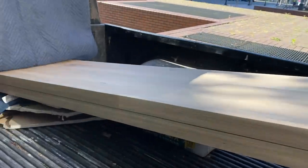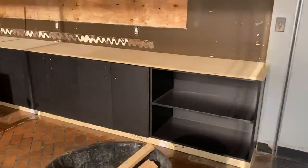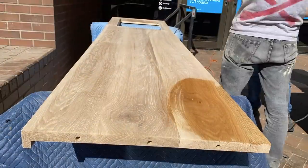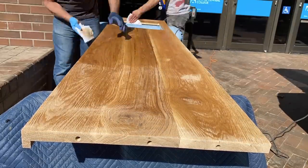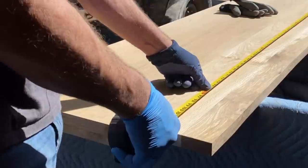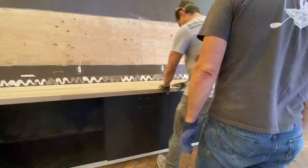We're at the job site ready to install. The countertops fit perfectly in my truck because I had them in two sections. These are the cabinets we're assembling onto, with three-quarter inch plywood on top for proper support. I apply mineral spirits to wipe off excess dust and debris, then fit the first slab into position. I measured where we needed to cut on one side and used a jigsaw with a fine tooth bit to accommodate a nice clean even cut in the field.